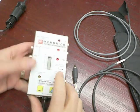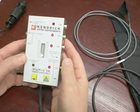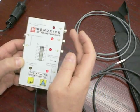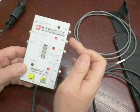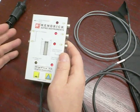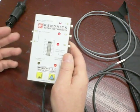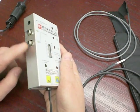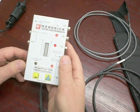Back to the outputs and inputs and how to program this DigiFire 10. You will note that there are six outputs on this controller, numbered on the face: one, two, three, four, five, and six. Outputs one through four are the only programmable outputs. Outputs five and six are dedicated to 12 volts — they cannot be programmed and are intended to run 12-volt devices. Any devices run from these must have a male RCA connector to interface with these connectors. You can run heaters from these outputs, but they'll be uncontrolled and will run quite warm.